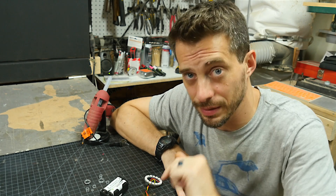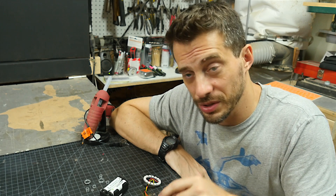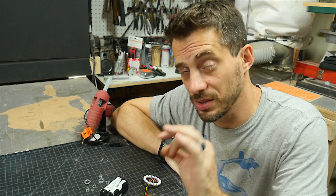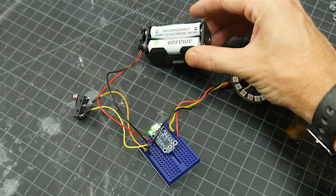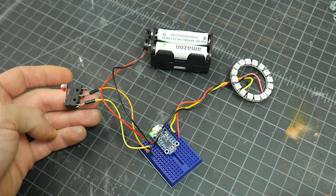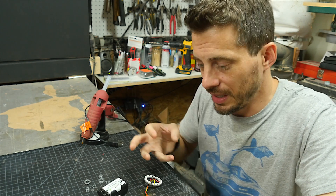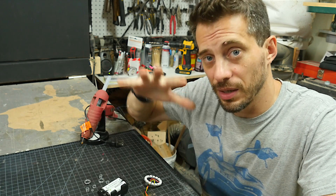The code will be linked down in the description. I've got a NeoPixel ring with 16 pixels on it, and an Adafruit Trinket, which is just a tiny Arduino — really inexpensive and easy to embed in a project like this. The whole system runs off 5 volts with AA rechargeable batteries. I have a temporary button to activate it, but it's going to be swapped out later. When you press the button, you get an animation of light that swirls around while you're holding it down, and when you let go, it all fades out.